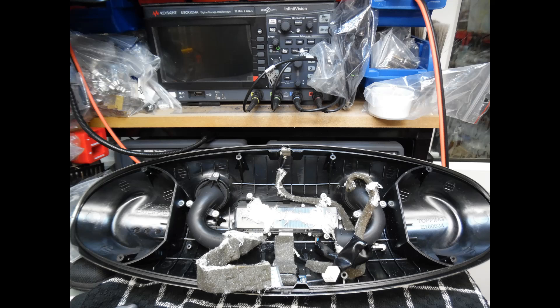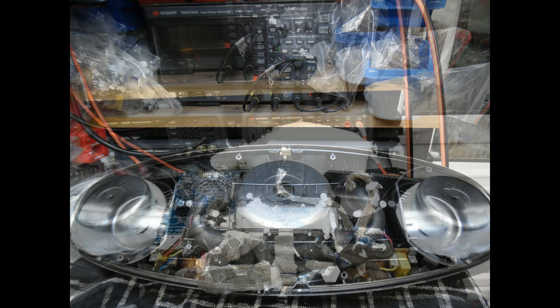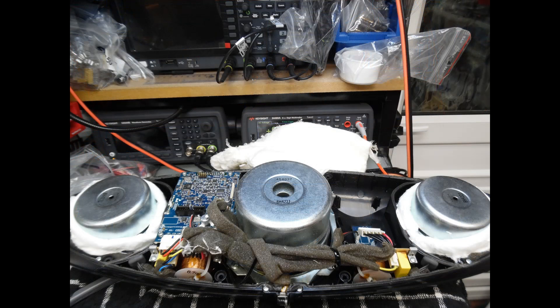Be very careful to remove the multi-ribbon connector connecting to the iPod mounting stand on the front fascia — don't be too robust with it; take your time and don't damage that ribbon connector. What I'm showing here is really where everything happens: on the left and right you can see the mid-range speakers, with tweeters right on the end, and the big unit in the middle is the bass speaker. Be very careful how you position this — I use a small mounting plate to prevent speaker cones and tweeters from being damaged.